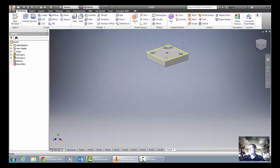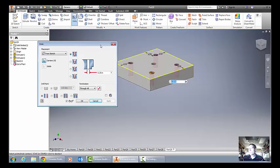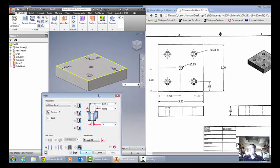All right, those are just points. Now we're actually going to use the real hole tool this time. There it is in 3D. Inventor knows to look for points when you're using the hole tool. If you bring your settings box out here, you can switch to the countersunk style right there. If I go back to our directions, we'll find that 0.38 is our hole size, so I need to change that right here. So the holes are a little larger.